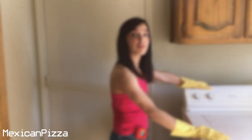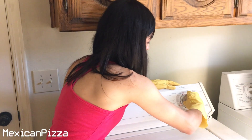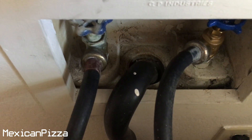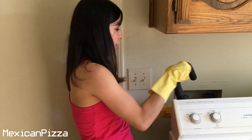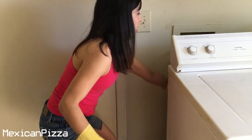Okay guys, I filled this up with some water so I can show you the problem — the drainage. I'm going to put it on spin so the waste water drains out. You can hear it back here. I'm going to try to stop it right before it overflows so I don't have to clean up the mess. Here it comes — you can see that problem. Basically this U-shaped tube is what gets rid of your waste water. So now I'm going to remove that, put it down on the ground, and then get my auger snake and put that baby in there.